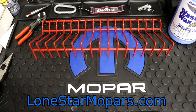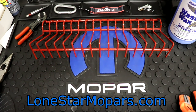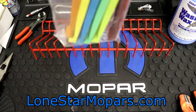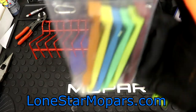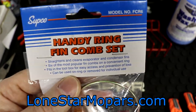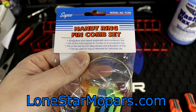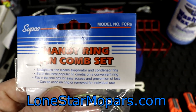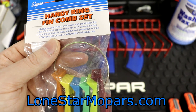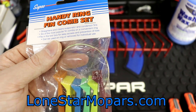We're going to jump in now to our third tool, which kind of ties in with something I picked up from KC Tool that I haven't gotten to make a video on yet. That's right — this is from Supco. This is called their Handy Ring Fin Comb Set. This set me back all of $8.26. Their part number will be FCR6. It straightens and cleans evaporators and condenser fins — six of the most popular fin combs on a convenient ring.